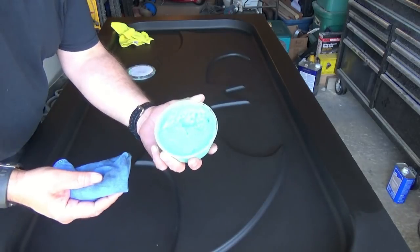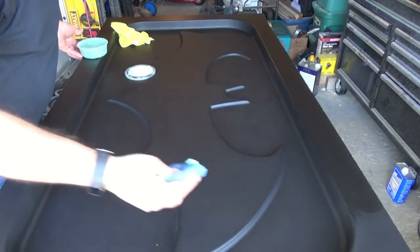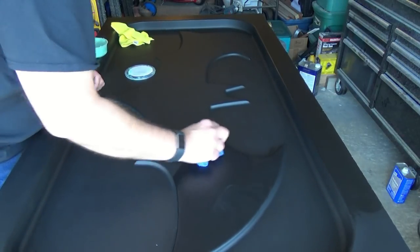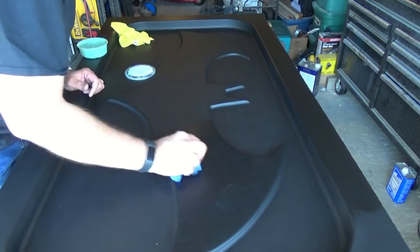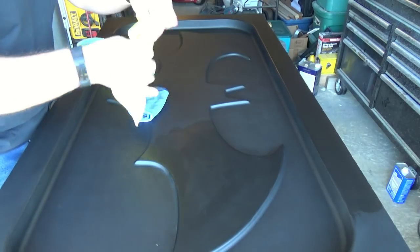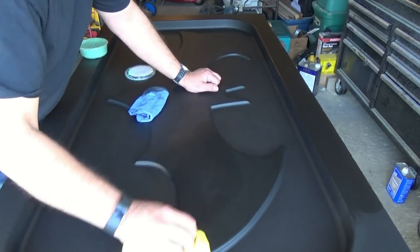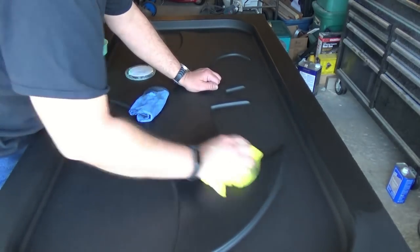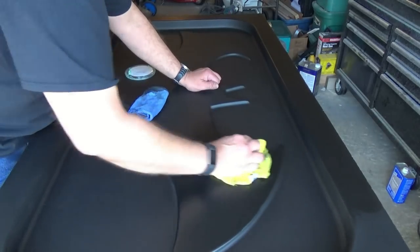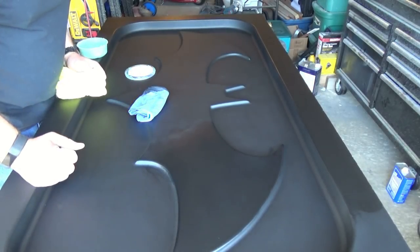The PVA wax is a pretty thick paste wax. We're just going to take a rag, get a nice little chunk of that on there, and slowly work it in onto the surface. It does soak into the primer coat pretty quick. My technique for this first coat is to apply it, come back and polish it off, then reapply a coat over top — that'll help seal the primer. Then we can begin really waxing our mold.